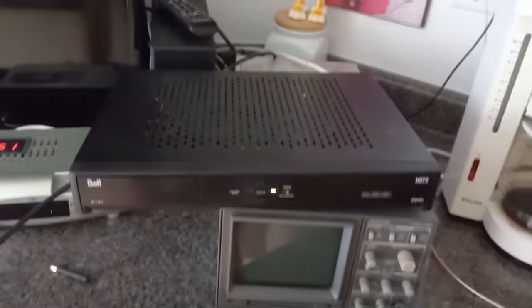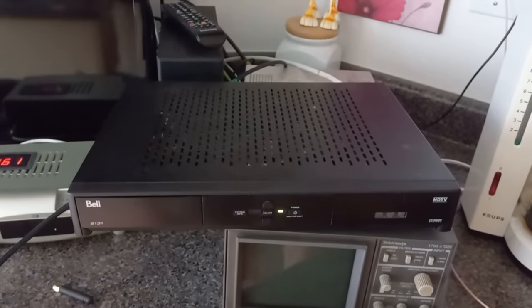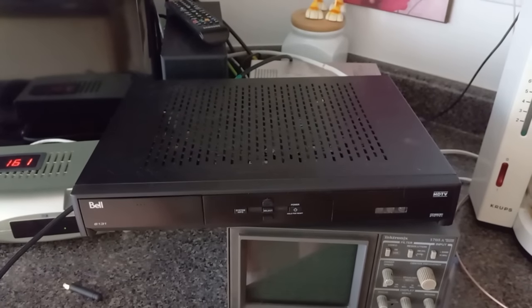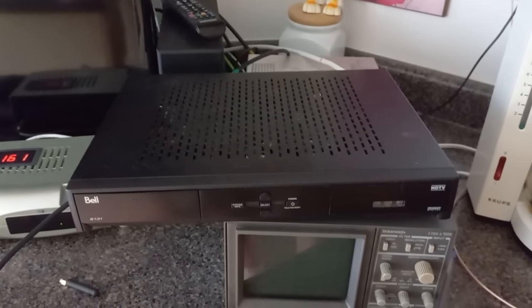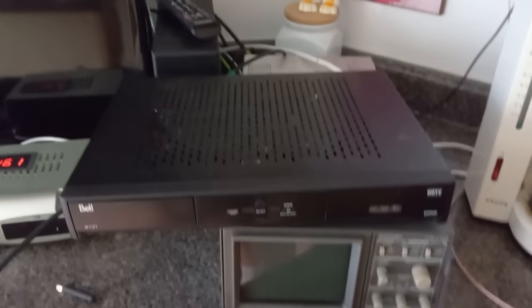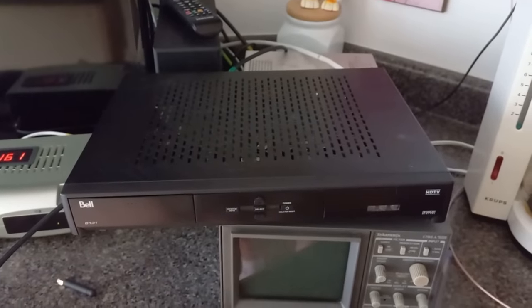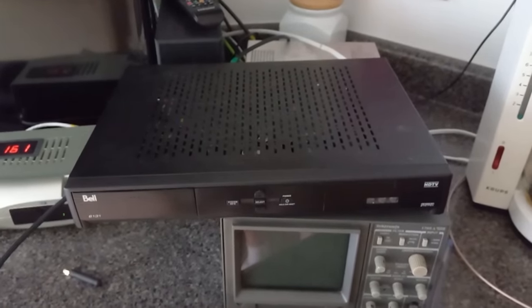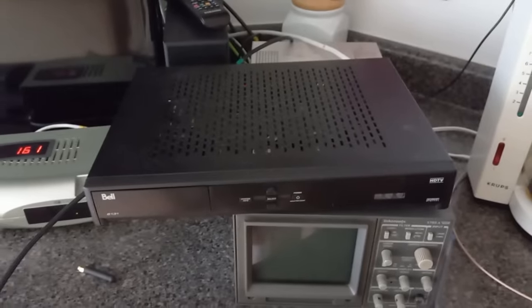Okay. Again, it's rebooting. This receiver is behaving really oddly. I think it's got bad capacitors in it. These receivers were notorious for bad capacitors, and rebooting like this and acting really slow. She's a sick receiver. Yeah, so bad power supply capacitors in this unit, most likely. However, I've got another one. Let's try the other one I got.